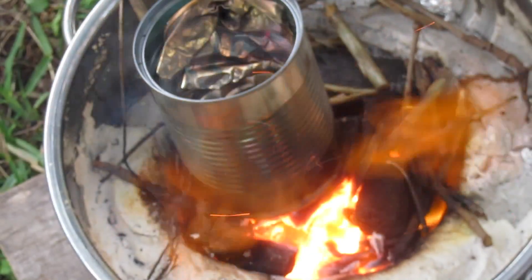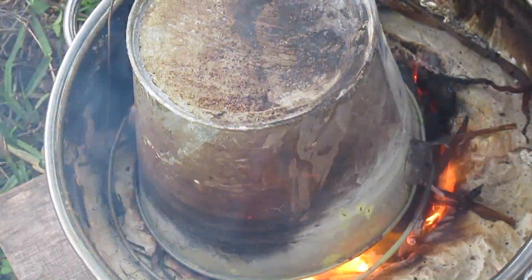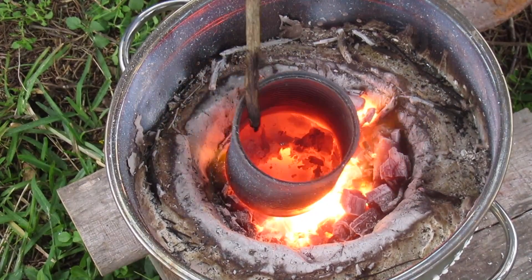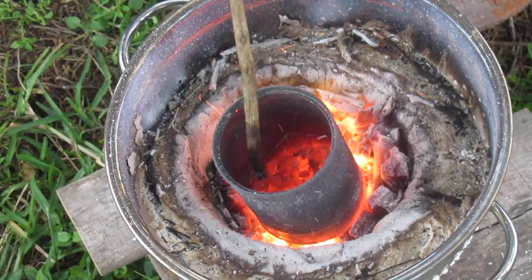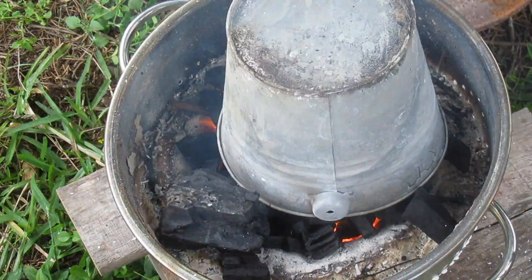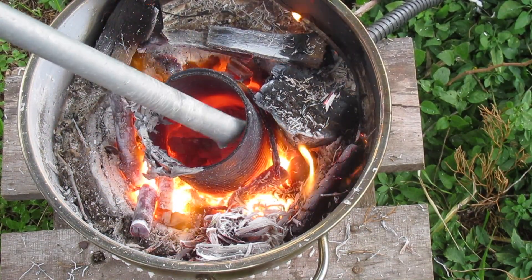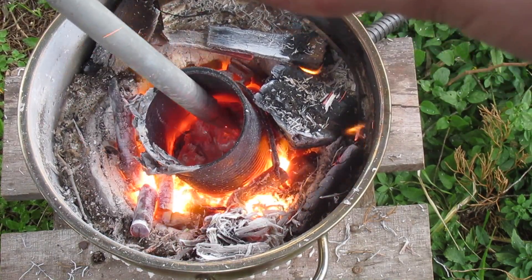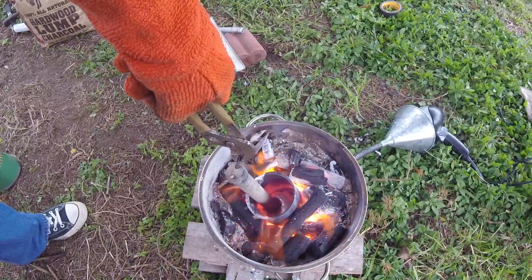Here we go. How hot is it down there? 450 in the cans — maxed out, nice. Making molten metal now! All right guys, the cans are melting and so we're going to put some more pure aluminum that Zeke has in here. There's the cans. So there's a lot of impurities in aluminum cans — that's kind of why it's that chunky looking stuff down there — so we'll go and try to put some more pure aluminum inside. Wow — we have down here some molten aluminum. Look at that! Now you know you've got it hot when you can just push and it melts. That's insane.